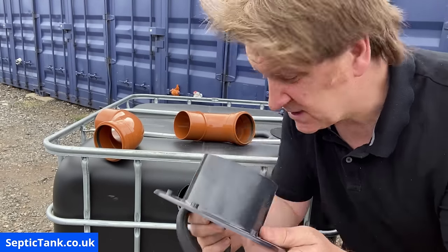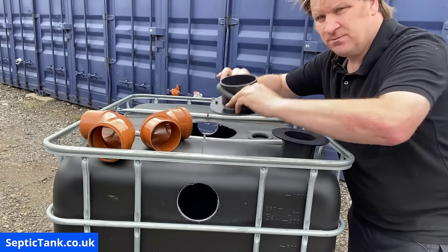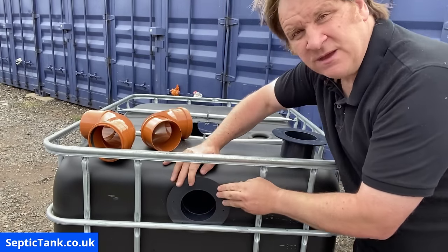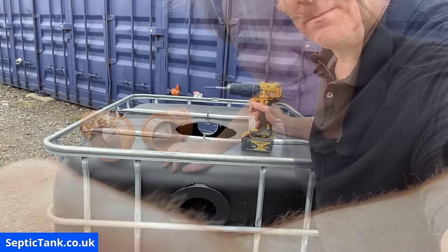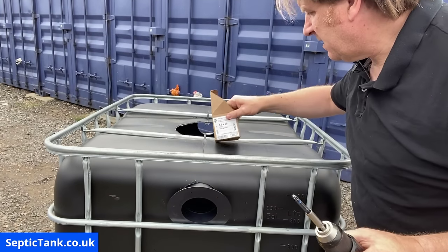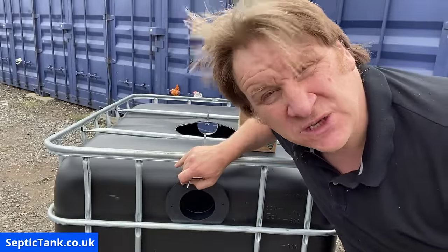The donut ring puts a really tight seal on the flange between the hole and where the flange meets it. Get your seal, stretch it a bit, and put it onto the flange. Then put the flange on the tank — that's a really tight fit. Get your screwdriver with a Phillips head in the chuck extension, and the 5.5 by 25 screws. With the holes on the flange, you're going to secure the flange onto the side of the IBC.